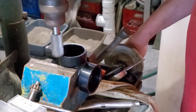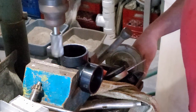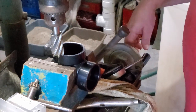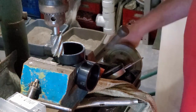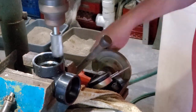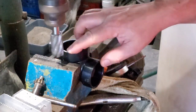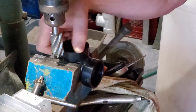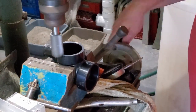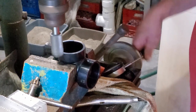The other thing I was thinking about doing instead was just adding another ring — there's a little ring at the bottom I'm using, and that's going to hook into this. But I don't really machine that much ABS, so I thought I would give this a try. Machining Delrin is really straightforward, and that's the plastic I actually machine the most — I make fittings out of that all the time. But every now and then I need to attach something to PVC or ABS, and it's just a good idea to keep those skills from getting too rusty. So I got a nice flat finish on this, and I will weld that up to the rest of the PVC — that will be the basis for my sink.